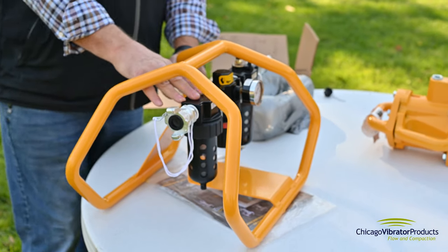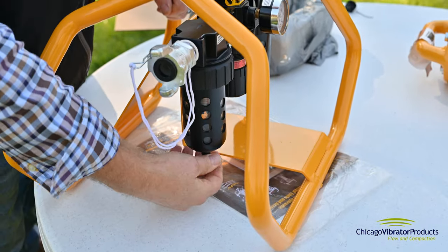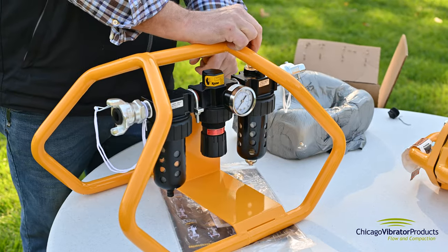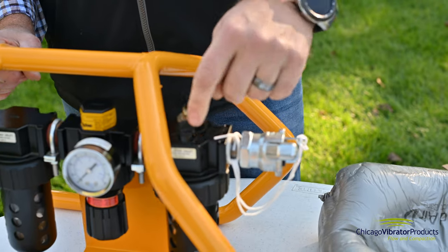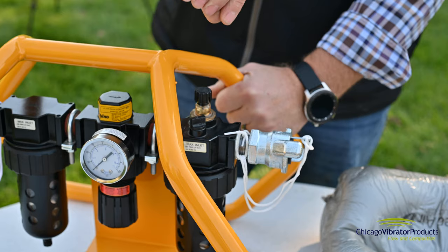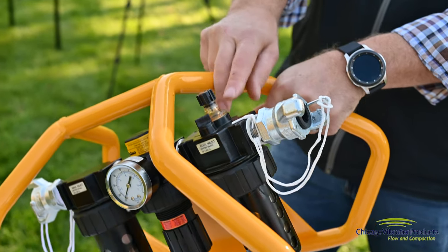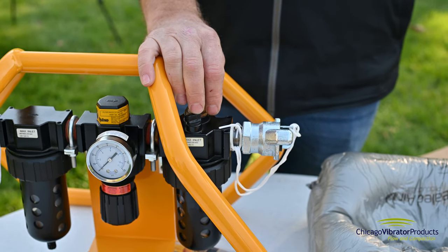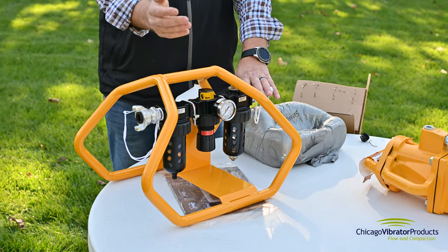Our filter-regulated lubricator does several things. It filters the air — all the water that an air compressor can produce and all the dirt will go through this filter. We rate it at 42 CFM at 90 PSI. You program it right here — this knob spins and once you turn the air compressor on, you'll see where it's at and adjust it up or down. Fill the lubricator here. When you hook up your hose for the very first time, open it all the way, then tune it back down to six drops a minute — you can see the oil drops in here. The reason to start with it open is because those hoses are dry, so you lubricate them all up first. We recommend keeping this within 25 feet of the tool so you're not lubricating 200 feet of hose.